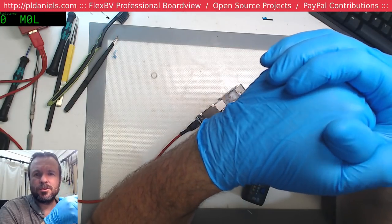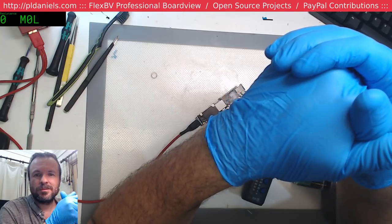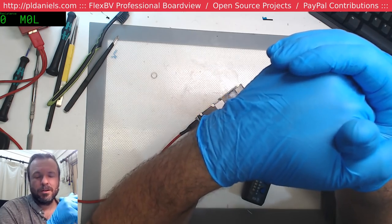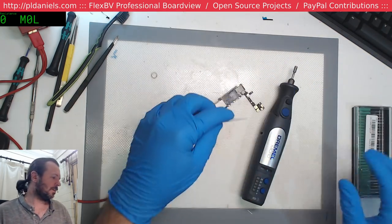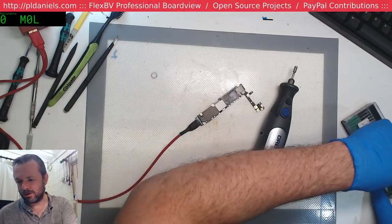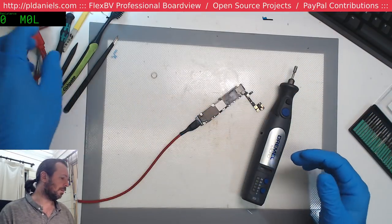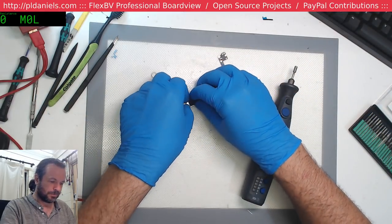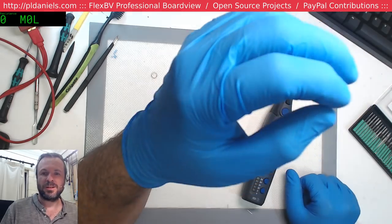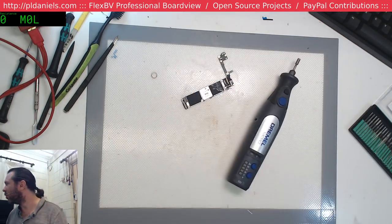When I see it's due to a short down the line, hey Jimbo. Alright, so what are you saying, Jason? That the short isn't actually on that corner, it's the LDO just generating a lot of heat because it's having to. Something else is shorting the line, but the LDO has to basically dissipate all that heat. So really, even if we, it's not actually going to fix the short.